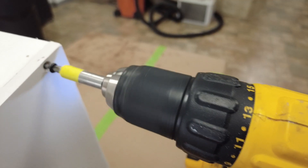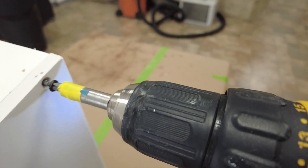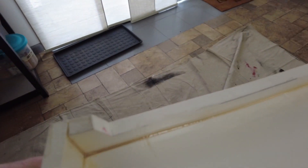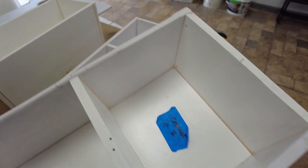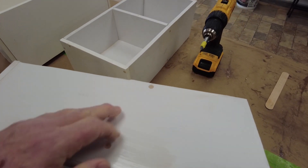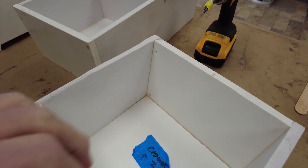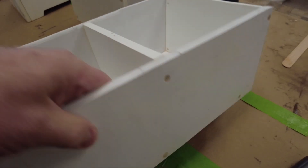Now we're going to remove the screws from the cabinet. Eventually we'll fill the holes with epoxy and then sand them down flush, and use a round-over bit to take off this edge. It looks pretty primitive right now, but it will clean up quite nicely later on. You can see we've reinforced the bottom with some epoxy fillets in the corners — should work real well. We've successfully glued these boxes together and begun to fill the screw holes with epoxy. Tiny fillets are laid in inside the box and everything is well put together — it's going to be perfectly strong.